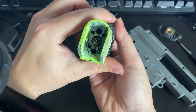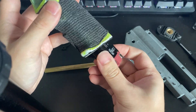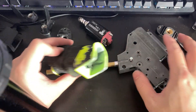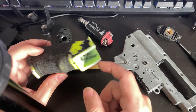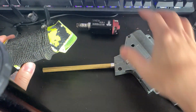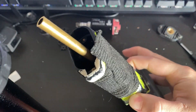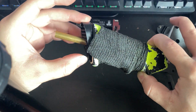When I push it down now, it's impossible for the spring to find a gap to get stuck in. Next, I also enlarged the back hole slightly — it needs to be at least wider than the front hole. This ensures that during any shift, the motor neck is still defined by the front hole and not the back one, since we don't want side movement either. Now let's put in the grip with the alignment stick in it — it goes in perfectly.